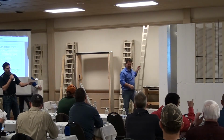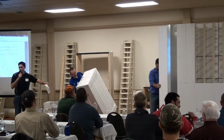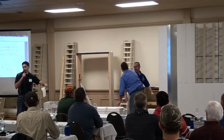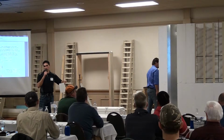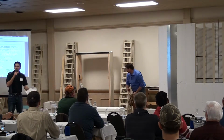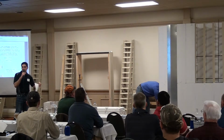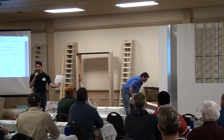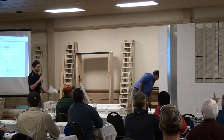But if I did have a splice here, of course I would set my corner in place, and then I would measure at the very bottom of my wall from corner to next poly panel to see what my dimension is there. So as close down to the footing as you can get to measure the splice piece. And then what we'll normally do is knock off about a 1/16 of an inch from your measurement, just so that your splice doesn't end up too big and start pushing your corner where you're not exactly where you want it.